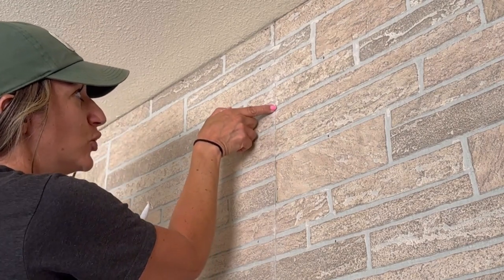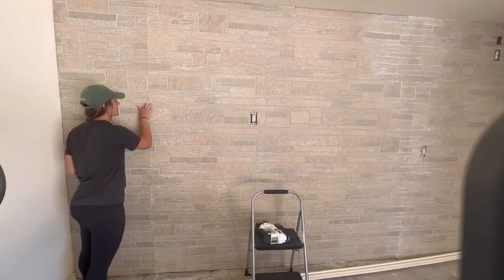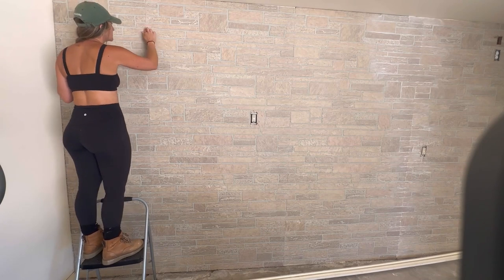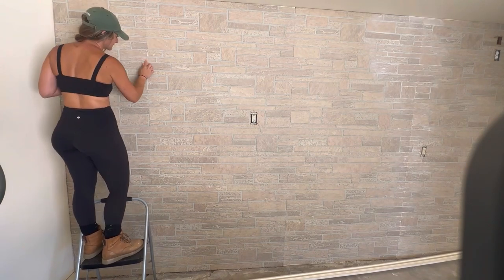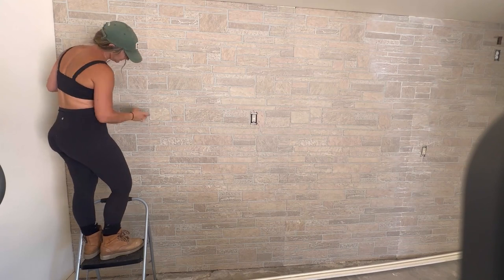Now I'm going to switch this out for the gray one and come in and only do the grout lines, then stand back and see how it looks. I know this seems super tedious, but it really didn't take me any more than an hour to complete the entire wall. Once the first coat is dry, I go back and check if any areas need an additional layer, since the grout can shrink when it dries.